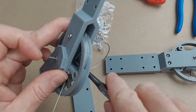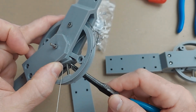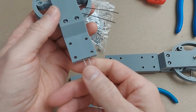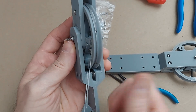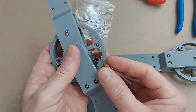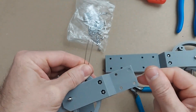Don't be afraid to use a pair of needle nose pliers to grab hold of that and help get the wire moving through there. Now I've got both wires coming through the channel — each of them going to one side over the pulley and entering the channel on the opposite side. Now I can put crimps in and secure the ends of these wires so they don't pull through.